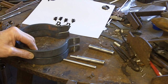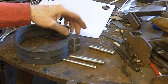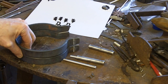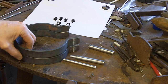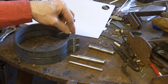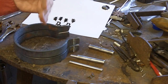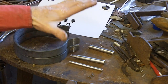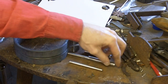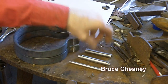These overshoe Oxbow stirrups are ready to be drilled out at the top. I've got my mark right here eleven-sixteenths down from the top, right in the center. I'll center punch that, drill a one-eighth inch hole in the center, then come back with a five-sixteenths and drill it out for my pins. Then I'll put a heavy chamfer on it with a three-eighths drill bit so the bead will lay down in there, and then I can dress that weld off and it will be stout. Here are the sleeves I've got cut that slide over the pins — I'll slide those in my holes and weld them down.